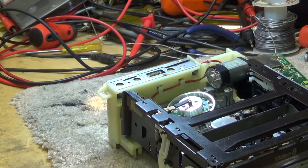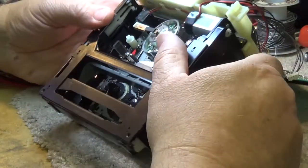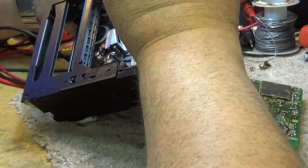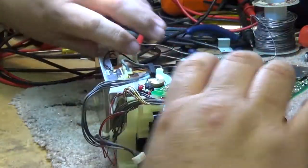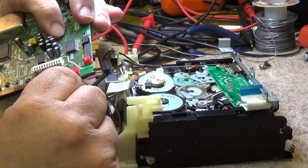Especially on an 8mm or a DV or a DAT player, because it's metal particle tape that is contaminating the heads, and a solvent won't dissolve it. You can't clean it by hand with a solvent. It won't do anything. You've got to use a cleaning tape to basically file it off. If the head is dirty, the abrasive tape is going to take the contamination away and not the head, at least in theory. In theory, it will clean the head and it won't wear the head away. If you only use it when the heads are clogged, you'll probably get away with that for a while. But if you use it when it's not necessary, well, they all say don't use it unless you need to, because it will wear the head out prematurely if you overuse it.